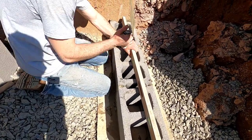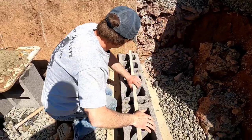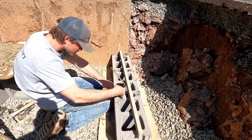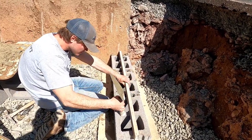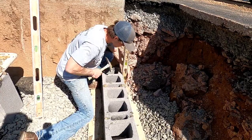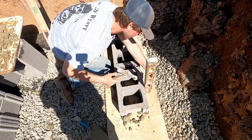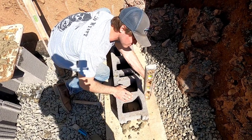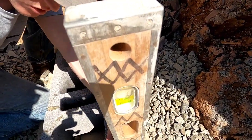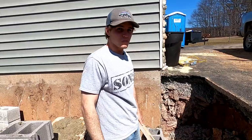I know my heights — make sure you're level across. Grab your hammer and your two-foot level, put it right on your web right here. Whatever side the bubble is touching, that's the side you tap down. See this? My bubble's riding this side of the level, so I tap the same side of my block — makes it level. Very easy.